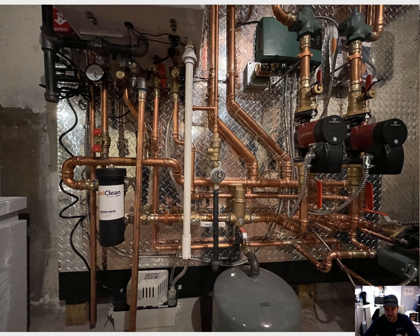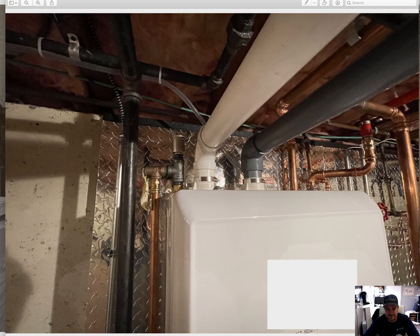I want to see the indirect piping. I would put my low water cutoff - my Guard Dog RB24 - right here, and again my Taco or my Caleffi automatic air vent there. This looks nice and fine.